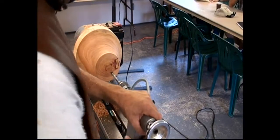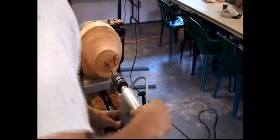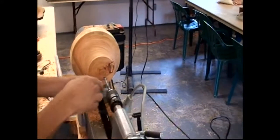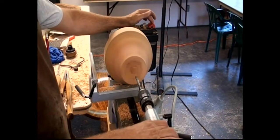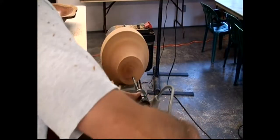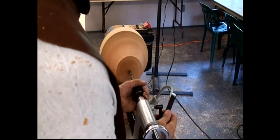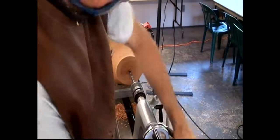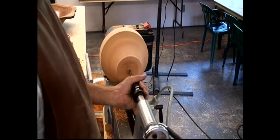Now instead of pushing this up and locking it and then turning it on, because a lot of lathes, especially with this long, have a little bit of play in here, if I turn it on first and then push it up, this is going to center itself and then lock it. See, that just went true. Now I lock it, and your hole starts a little truer.